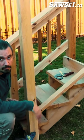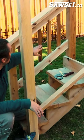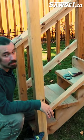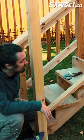So you cut your saw to 34.5 and you're good to go. You can cut your struts, your spindles, your posts, your rails, everything. It's all the same angle, you've got your setting ready to go, so that's about that.